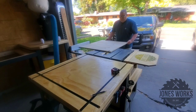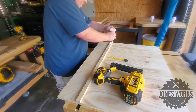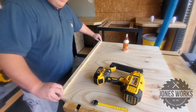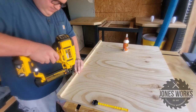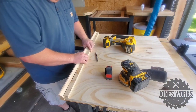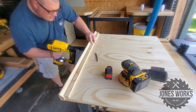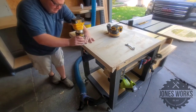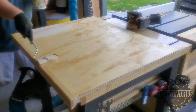Last thing for that center platform — just cutting the plywood top now. Here's an additional strip just for a better glue surface. It was cut a little long so I had to trim it shorter. This piece of trim is beveled — just a scrap from another project, but it was ash anyway, so I just wanted to use up what I had. You won't see it from the front anyway, so no big deal.